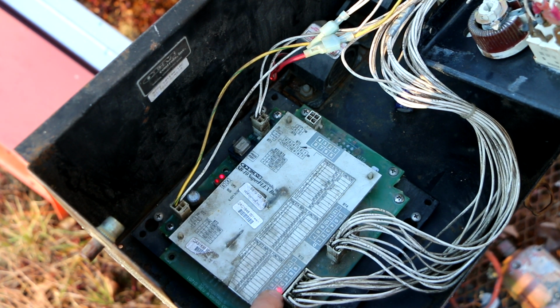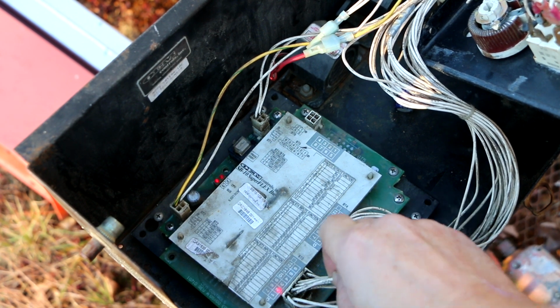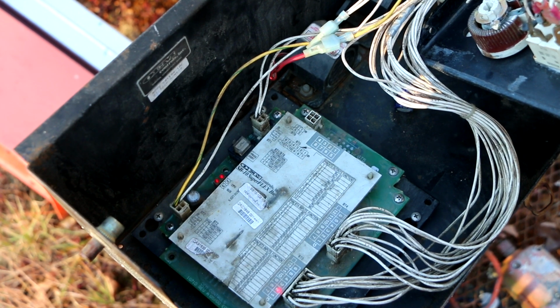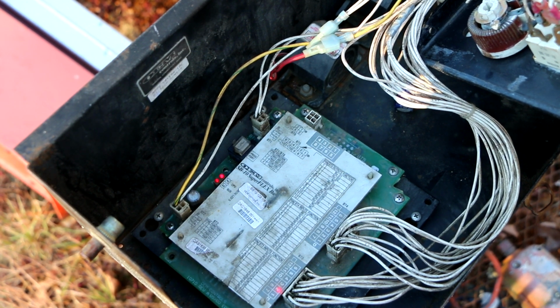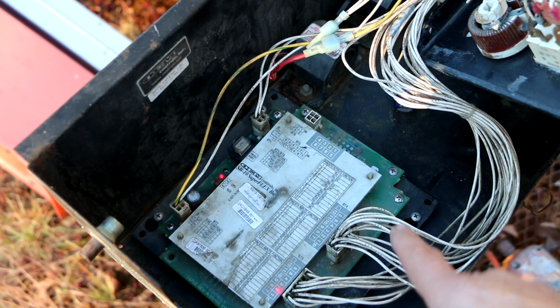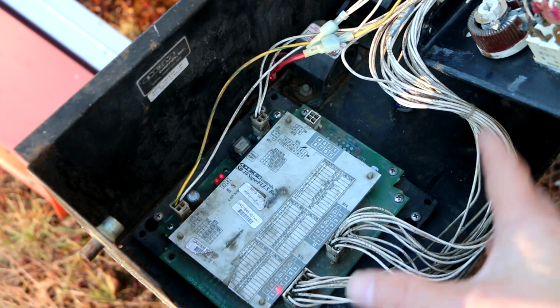But number 2 goes to this wire, which is wire 306. And wire 306 actually goes up to the key switch up here. So I certainly don't think that's the answer to my questions here, because essentially what that's going to do is, well, what is that going to do? I guess the point I'm making is I think that's normal for that to be on. I got a feeling that 306 is going to be one of those wires that if I go back and look to the wiring diagram that I found online, I'm not going to be able to find it even.